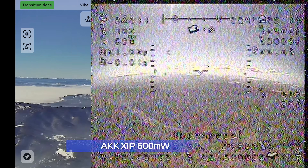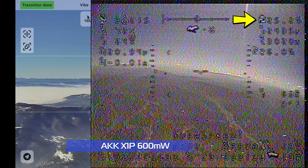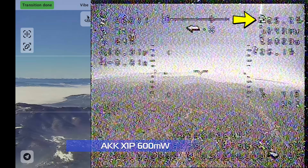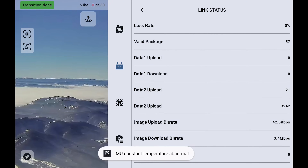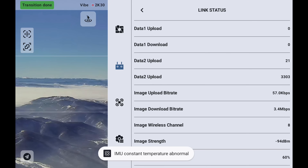For a comparison, from deep in my archives from quite a few years back, here is an example of what analog looks like at 600 milliwatts at around 26 kilometers out on 5.8 GHz, with very high gain directional antennas on an antenna tracker, carrying a lot less data and at a much lower resolution. It boggles the mind — it is absolutely fascinating how technology has improved over the past decade.